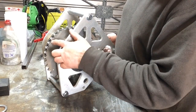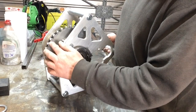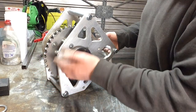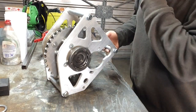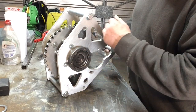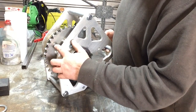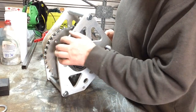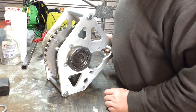As you can see this sprocket has got a two piece sprocket — it's got a split line in here. It's quite easy to change your sprockets or your chain if you have the split sprocket. It saves you dismantling the entire set of drive shafts and pulling the whole differential out just to change a sprocket. There is an alignment bush in the two split lines which helps you keep the constant gap when you're assembling the sprockets onto the differential.